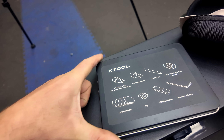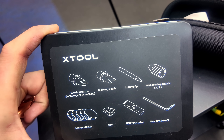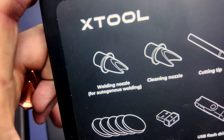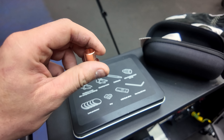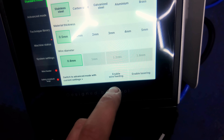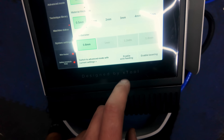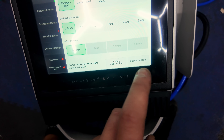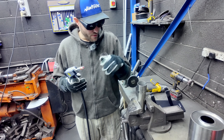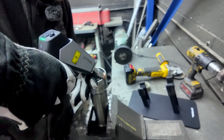For this we're going to need to switch to the autogenous welding tip. Autogenous is just a fancy word for welding without filler wire — you can see on the consumables box exactly which tip we need, and this is the one right here in my hand. For the welder settings it's very much the same procedure — we just go on to weld — the only difference is that we do not want to enable wire feeding, as we have no wire with this tip. Select all the materials as you usually would, just do not enable wire feeding. I've not used this function before so I've set up a little dummy piece — this is a real customer's job, I don't want to mess it up, so let's have a little test run first.